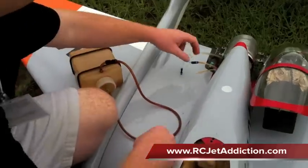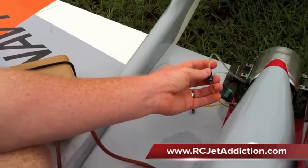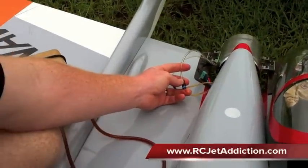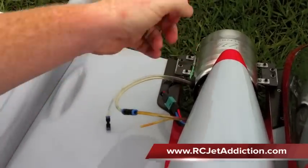Get pump stop. So we connected the main fuel line back up to the engine with the pump off, obviously. We're going to run the pump for a brief second to make sure we get fuel right up to the engine. And stop. So now main fuel is to the engine.